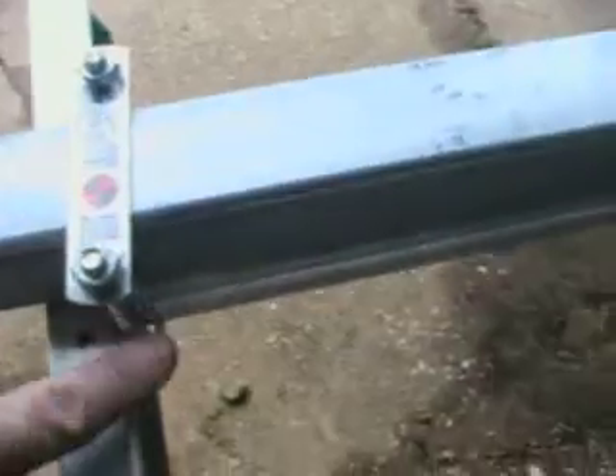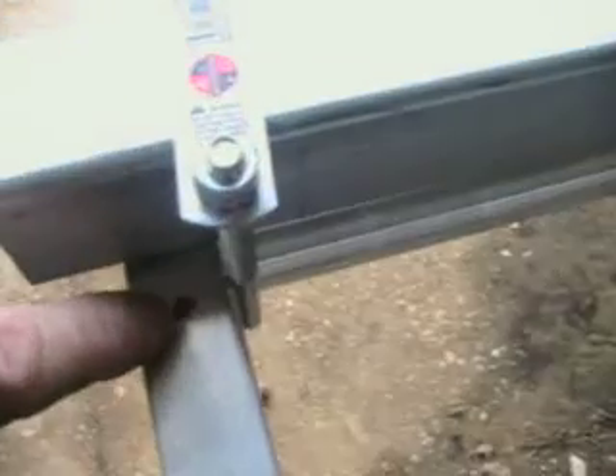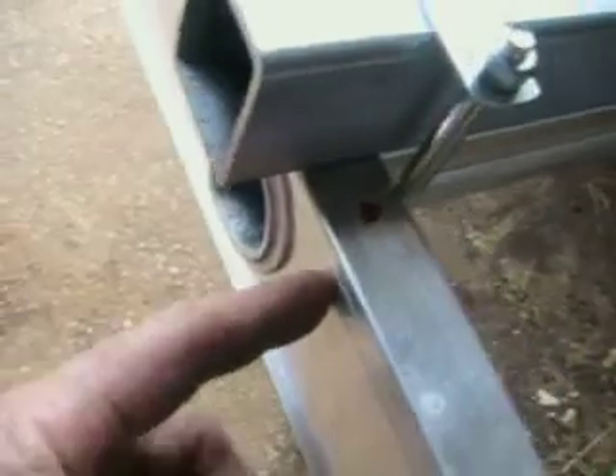However, there's one thing you have to adjust: the motor fits perfectly in between the side rails, so these would get in the way right here. You simply drill a hole right here in the middle, avoiding this outside plate, and run this part of the U-bolt through it, because the motor will attach snug against this part here.